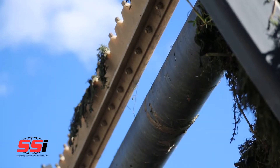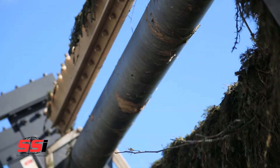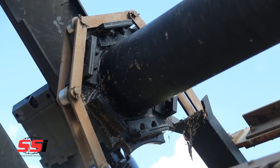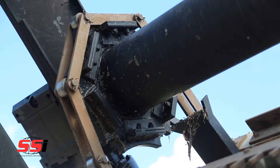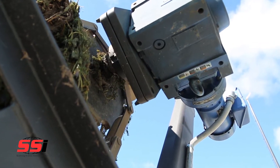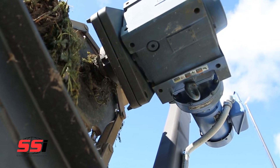The torque tube head shaft assembly is built for strength and stability. The carrier chain engages in fabricated sprockets to ensure positive even lifting, which is especially important during high loading periods. Our electric motors and speed reducers are sized for the application and are rated for heavy duty outdoor use, so they will stand up in any weather.